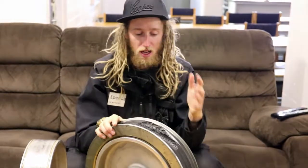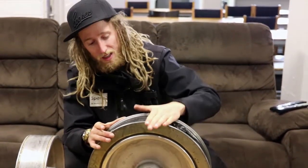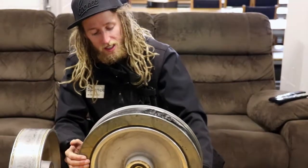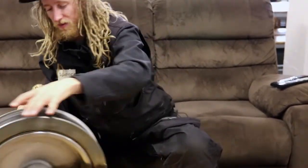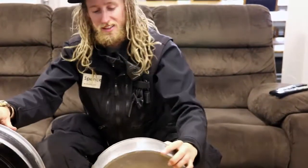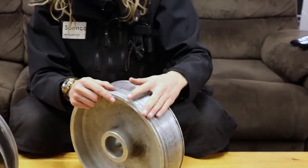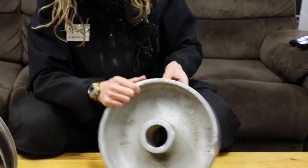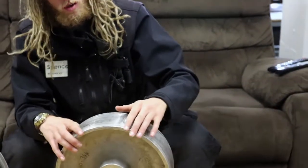When we're de-icing, I'll mention it a few times about where we can and can't hit. This outer part here is steel, so we can hit this quite hard but not super hard - making sure to hit all the way around to clear any ice. But this inner part here is much more delicate, so we're going to have to be really careful. If you look at this part here, right here we have a pretty substantial crack because this has been hit by a de-ice hammer, which has cracked this part of the sheave and again, this would need to be replaced. There are a few minor dents and wear here and there - that's okay but far from ideal. So when tapping the inner part of the sheave, be really gentle, sometimes even using the back of the hammer instead of the hammerhead.